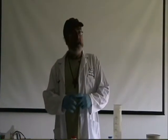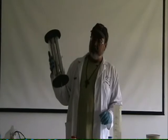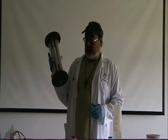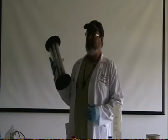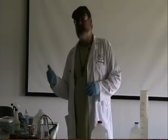On the table outside you have some coils — would you like to talk about that? The coil I have outside is a four-inch toroidal core, micro metals number T400-26. I'm using those as inductors to pair with this capacitor. The way Stan Meyer had it worked out, he had capacitors and inductors to create a tank circuit. I haven't gotten that far with my research — I have all the equipment to do it, but I keep not being able to catch that elusive time. I plan on using those inductors paired with the capacitor to create the tank circuit, and also I will wind additional secondary wraps on it and create the VIC — the voltage intensifier circuit — out of that inductor core.